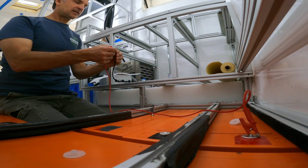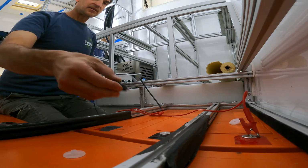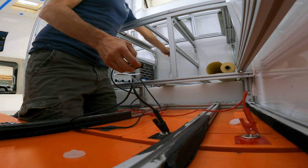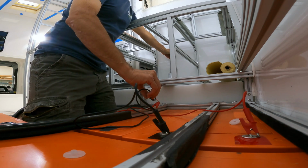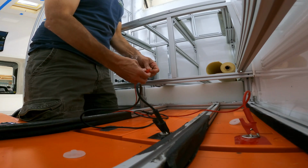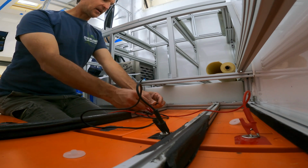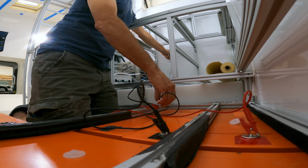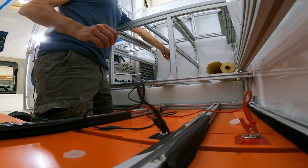And now hook it up to this linear actuator. Try to make sure I'm doing this safely. We're not going to short something here. So I've got these little leads here. Partly it's also so I can reach over and hold this, because as soon as I clip this, it should start moving. Well, that's not a good sign. It did, and then it stopped. I know what's probably happened. That's probably reverse. Positive and negative are probably that. So what I've got to do is reverse polarity, right? It's just going to go the other way. Let's hope I'm right. Okay, I'm right. Whew. Not breaking any linear actuator.